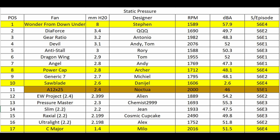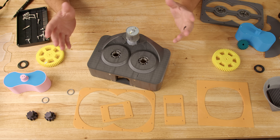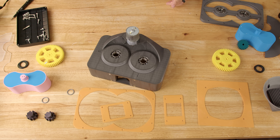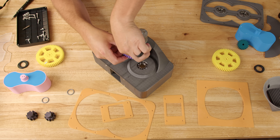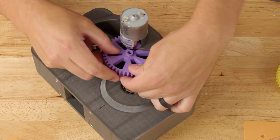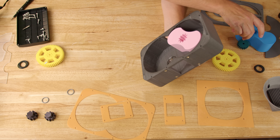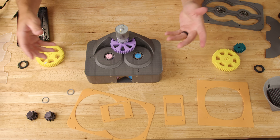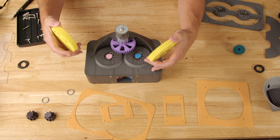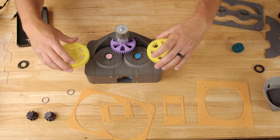We're shooting to beat the Wonder from Down Under — I think it got 8 millimeters of H2O in our last fan showdown. Step one is installing the motor, which I've already done because it's finicky — this is a horrible design choice, it should have been separate from the case, but that's here nor there. Step two is installing the drive gear. You can see there's a flat on this gear that just aligns with the shaft of the motor — pretty straightforward. Push it on. The lobes go in pretty straightforwardly right through the bearings. Aligning them is the finicky, tricky part — there's only one way the gears can go on, and as long as they're meshed and aligned with the witness marks on the cage and gears, the lobes should be in the correct place to spin freely.